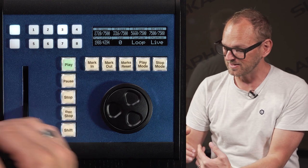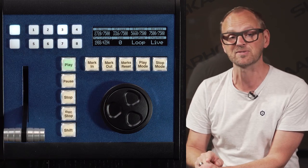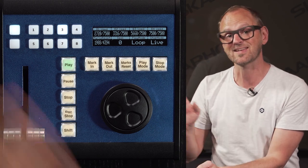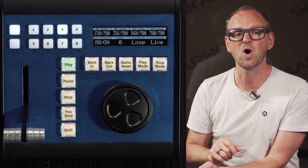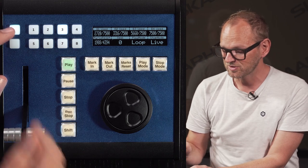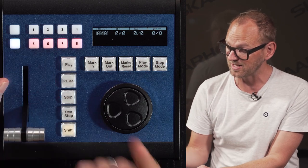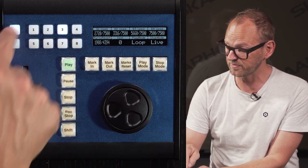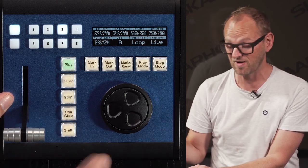The panel buttons indicate or select the buffers in the camera. There are up to four buffers, or you can have one, two, or three, depending on how many frames you want in each buffer. The camera can record around 30,000 frames, giving you one minute of slow motion recording at 500 frames per second. With the knobs you can select between four buffers or go all the way down to a single buffer. When choosing four buffers, you get 7,500 frames each — so 15 seconds of slow motion recording at 500 fps.